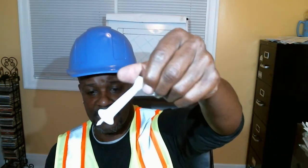Alright. The next one is a heavier duty one that goes onto the baseboard. Now keep in mind, all these door stops come in different finishes. You can get it in white, black, brass, nickel, whatever finish matches the decor of your normal locks. This one works the same way, it's a solid one. You make a little pilot hole and then you basically screw it in. It also has a hex design on it where you can put a pair of pliers on it and turn it to put it in.